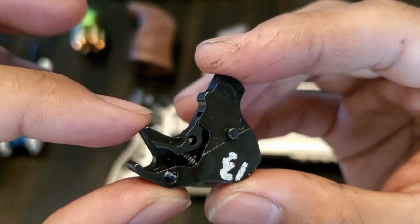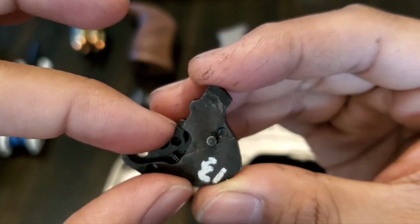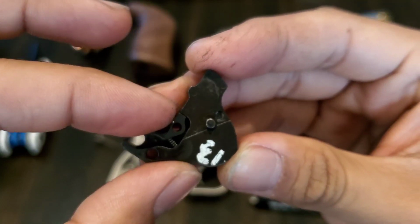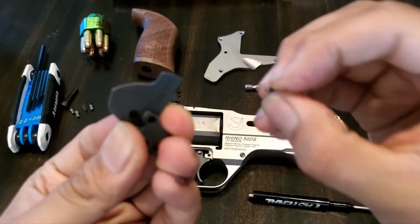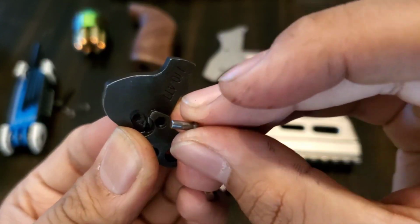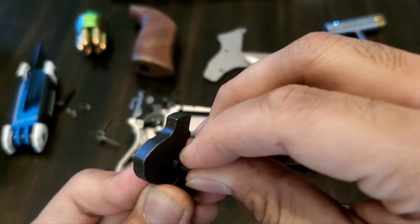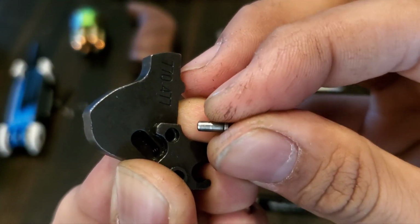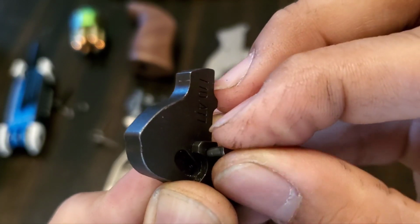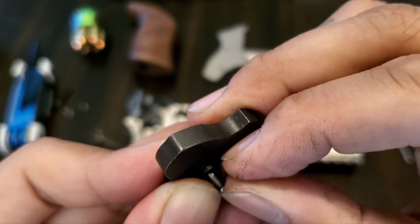That is the double action conversion kit for your Chiappa. So now you want to just slightly put some tension on it. You want to flip your piece around and take your cotter pin. Now it goes right into there, the back. You can see in the back there's a groove mark, and this goes right inside. So the cotter pin will fit right behind here. It's going to be a little bit difficult because it's a tight, snug fit.